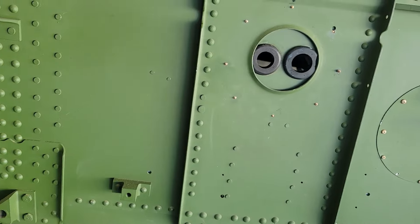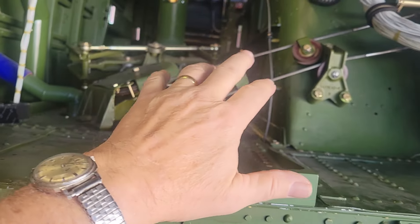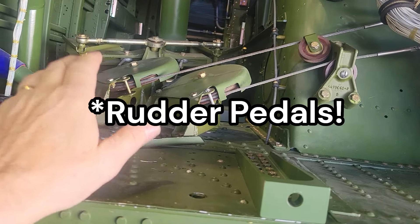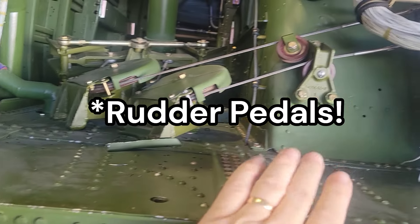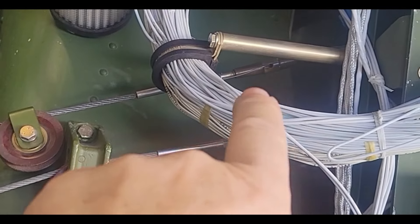Today's task — now that the airplane has stopped running, I'll show you what I've been doing. These two cables right here are the connection for the rudder cables from the co-pilot's side to the rest of the airplane. We just tensioned them and safety wired them.